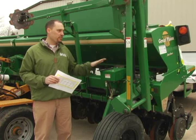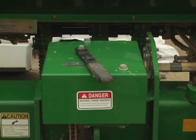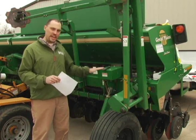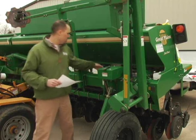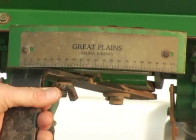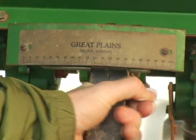On a Great Plains, make sure that the transmission is in the lowest setting. On this particular drill — a Great Plains 2020 — we're going to be in drive setting number one, transmission setting number one. Because this is an eight-inch model drill, we're going to make sure that our notch setting is at number 60. At times these drills have quite a bit of play, so go all the way to zero and then move it to 60.